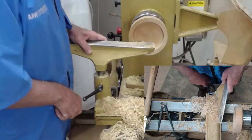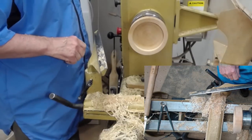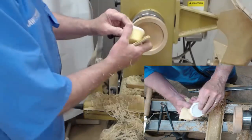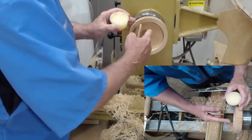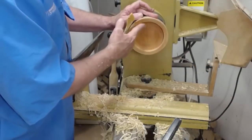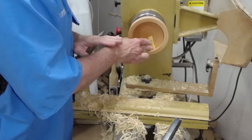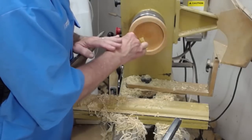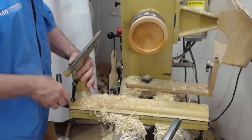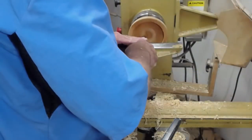That's nice and clean now, and this is my final opportunity on this surface, so I'm going to get out some sandpaper — I think 220 will do it. I'm going to do some wet sanding. I've made some sanding butter out of beeswax and mineral oil. I've got this mounted, trued up the face, cleaned up the inside, trued up the recess, put on a little sanding butter, and now I'm going to finish with wet sanding. I'm also going to add a little bit of texture in here — got a very nice textured pattern. I'm going to use my V-scraper to better define that.